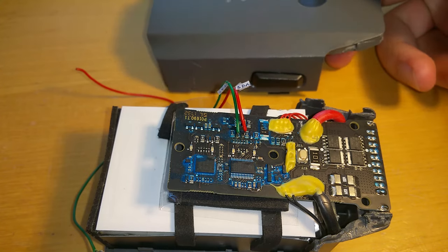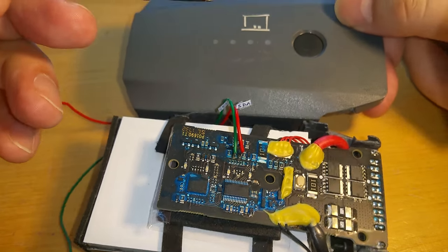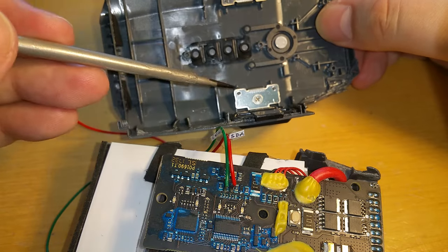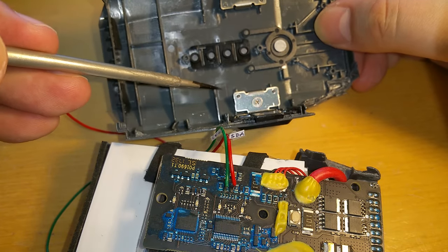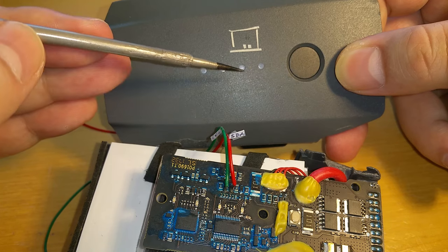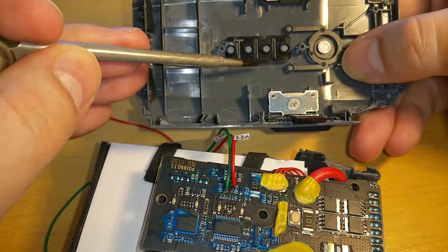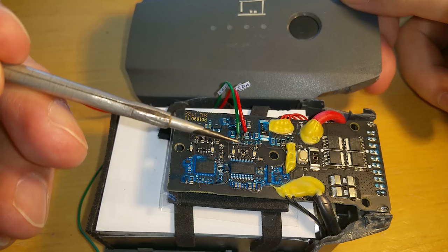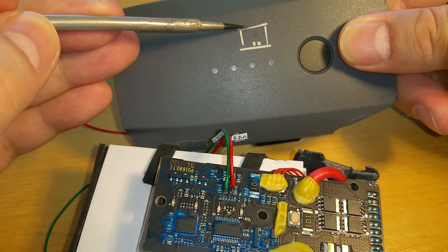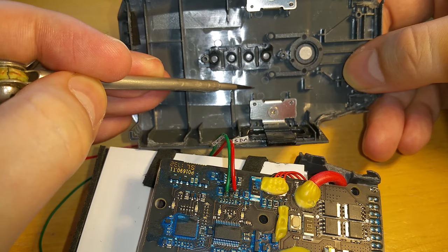The idea is to drill a hole. Here I marked the area which is safe to drill using tape, and I also marked the places where we expect the connection points to be. The distance between the middle of the LED plastics and our work area should be at least five millimeters — actually exactly five millimeters, because that is as far as the LED plastic reaches. The LED plastic is covered with rubber to avoid light interference, but the distance between the LED and the pad we want to solder to is also five millimeters.